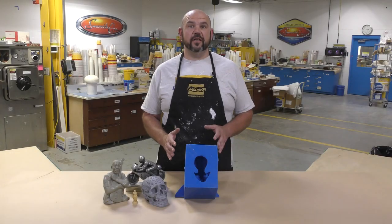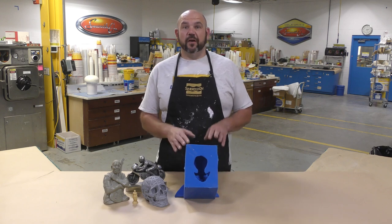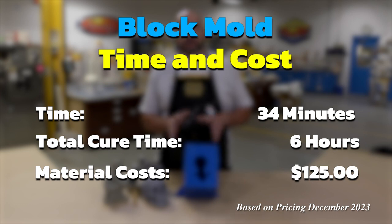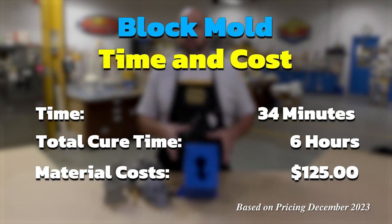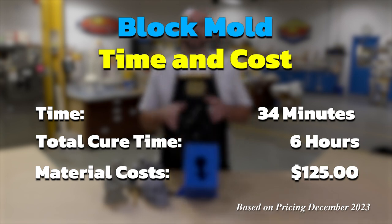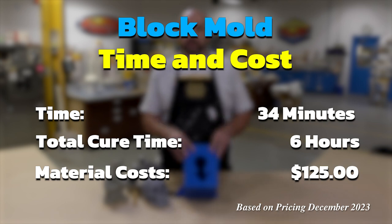All right, so let's take a look at our block mold here. The working time for this mold was 34 minutes. That means we took 34 minutes to construct the mold box around the model, mix and pour the material into the mold box. The mold was then allowed 6 hours based on the material cure profile to cure so that we can demold it. So 6 hours and 34 minutes is the total time it took us to create this mold off of our model.